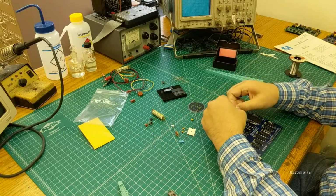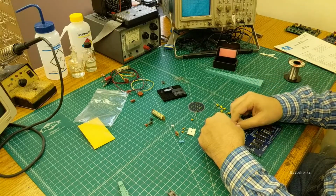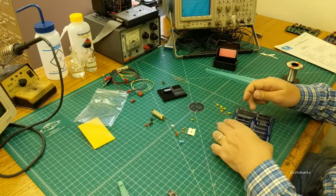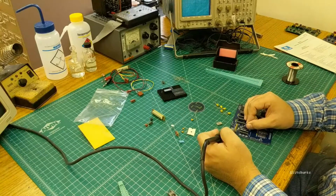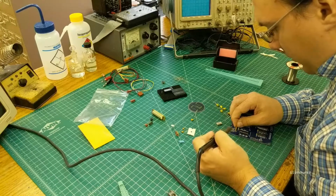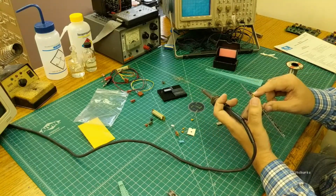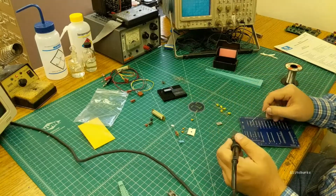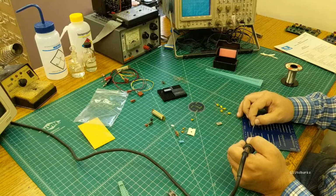The next shortest item is going to be your resistor pack. And the trick to the resistor pack is, first have all the legs straight. Sneak in under one of the pins here and solder it on the top, just to hold it in. And then you can look down from above and straighten it up. These do have a pin 1 on them. It's marked with a little dot. The dot needs to be toward the square area. And if you get that in backwards, it will cause problems, so don't do that.